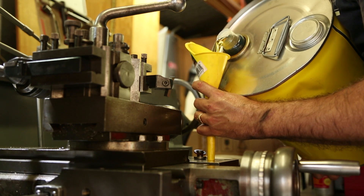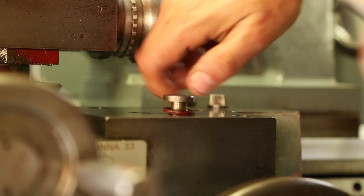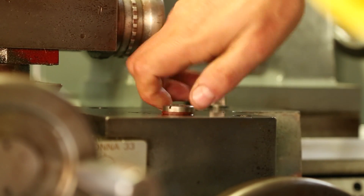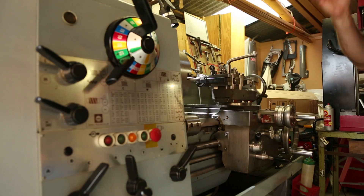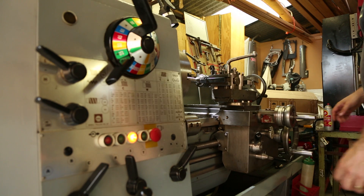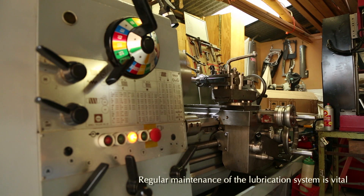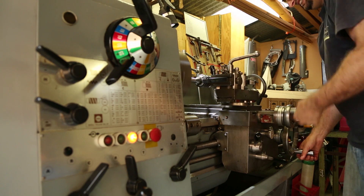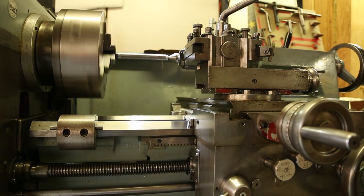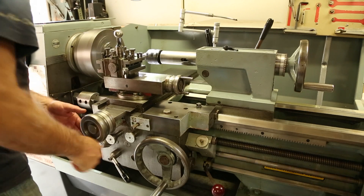Finishing up this process is a bit messy of course — just cleaning up all the oils and responsibly getting rid of the old oil. However, I'm pretty happy that I've done this because I now know exactly what's in my machine. The last thing to do was to start it up and put it through its paces, just to make sure the carriage was also operating correctly and receiving oil when pumped into the right places. Overall I felt the machine is running smoother and definitely got a little bit quieter, probably because it's now been topped up to the right level and maybe also because the oils themselves were performing better. I hope this video has helped somebody out there with a Colchester lathe — thank you for watching.